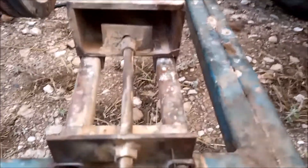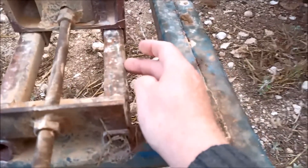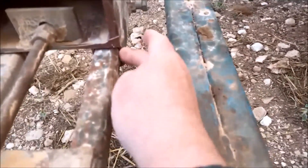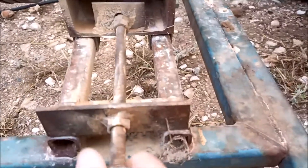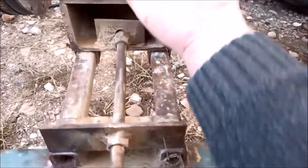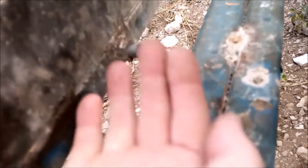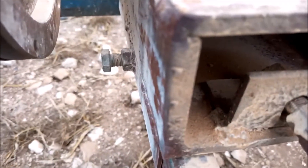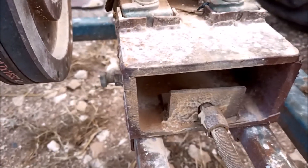The belt tensioning mechanism is very straightforward and simple. We've got some square stock here and another square tube, and a piece of threaded rod. You wind it in — there's a nut here — so you wind that in and it pulls it tight and you get your tension. There are locking nuts here so when you adjust it you can pinch it and keep it in place.